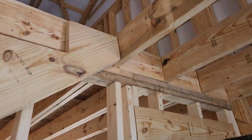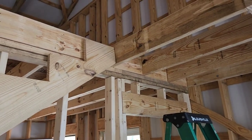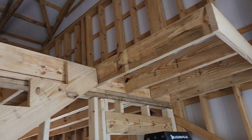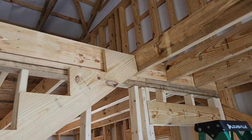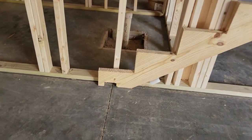Once I flush that out on the bottom, I've got right at three-quarters of an inch between that top step and the top. So when I put my inch-and-a-half tread on there plus the three-quarter-inch subfloor, they'll flush out. So I'm three-quarters there — nice rise and run, and down here on the bottom we're golden.